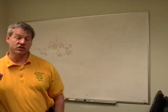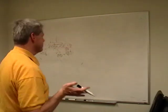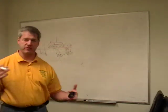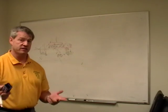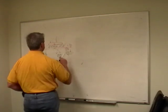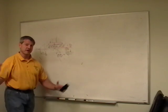In a digital circuit, they start to leak more, or you can't turn them on. Either of which is a bad thing. You're either using more current or you can't make your stuff work. Eventually the charge gets built up enough that nothing works. When we talk about space electronics and radiation, this is called your total ionizing dose. It's the amount of ionization that gets in here, and it can cause this to not work after some amount of time.